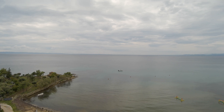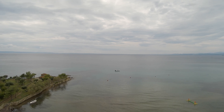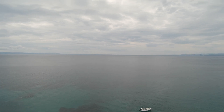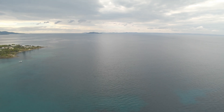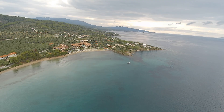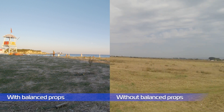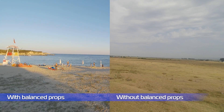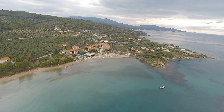With my balanced props in hand and the Voyager, I went on my vacation. The vacation spot is roughly 400km away from my usual flying locations, but for the first flight there, I did not do any calibrations and as you might expect, first chance it got, it did the dip and hover trick, luckily only once. Even though it was a calm afternoon, the gimbal was pretty shaky, though I have to admit, hearing it hover at the start and end of the flight, I can tell you that the balancing made a difference.